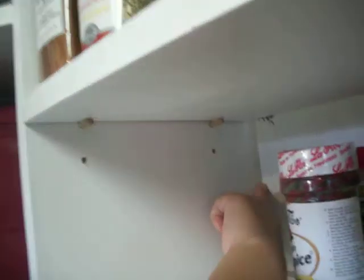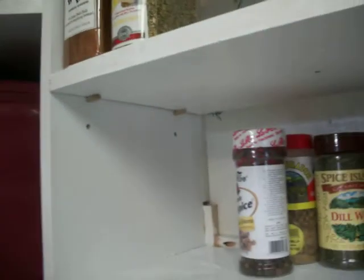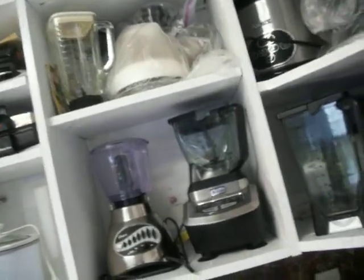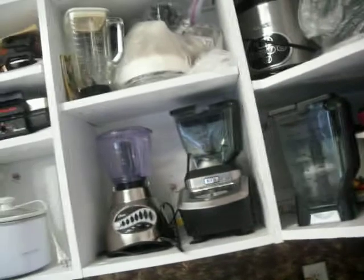And over here, all these cabinets, I put a little strip of wood in between the cleats. And I'll probably do that here too, eventually. With the scrap wood, I'll just rip a bunch on my table saw and put them in here. I only had to use glue on two of them. The rest of them I just kind of tapped in.